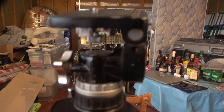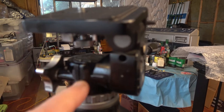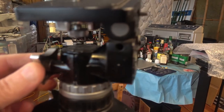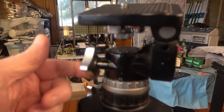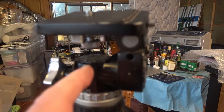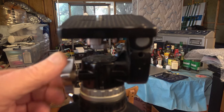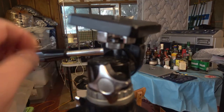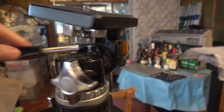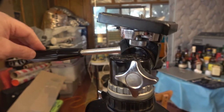Today, getting rid of a couple of small jobs, I thought I'd finally get around to having a look at it. I put in a lot of 3-in-1 oil into the contacting area — it still wasn't quite there. So I slackened off the nut and got a screwdriver in here and just expanded it with a bit of brute force, fairly evenly across there, until it became loose. And now it just works brilliantly. Tighten that up and yep, it locks it nicely — no problem. Just a little bit of looseness and free as a breeze, because when you're panning, the last thing you want is it being really jerky.